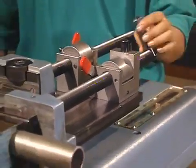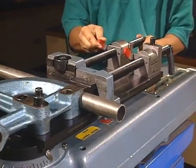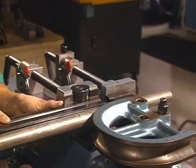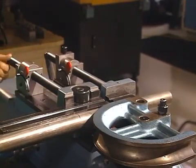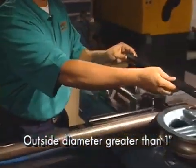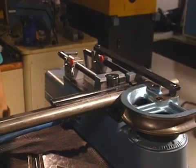Once properly positioned, clamp the tube with the clamp block vise. Then advance the slide block vise with the rapid positioning sequence noted earlier. Rotate the slide block retainer to the proper height, insert the slide block, and bring it snugly against the tube. Since too much pressure will prevent the block from sliding freely, the clamp and slide blocks should not be touching. The tie bar is used with heavy wall tube, tube with outside diameter greater than one inch, and in mandrel bending — it keeps the tube from slipping and the clamp arm from flexing.